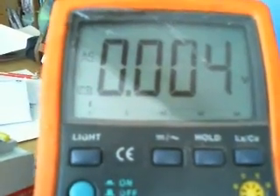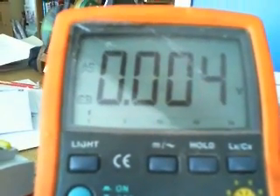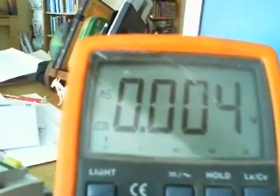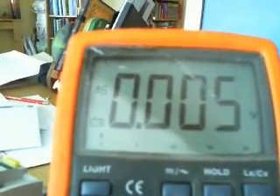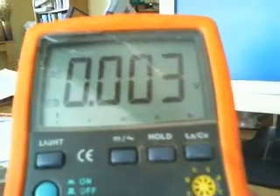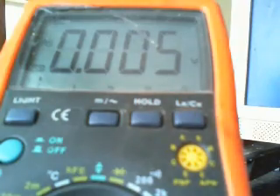First of all, here it is without the magnets in position — I've just taken those two magnets off. Let's turn the oscillator on and touch the D-cell. It goes up to about 300 millivolts. Here's my voltmeter turned on, and if I just touch that D-cell to it, you can see that we get a spike out of it.